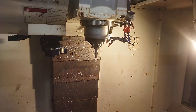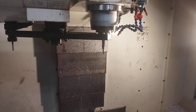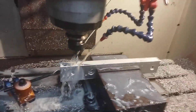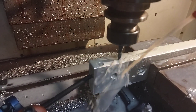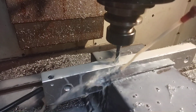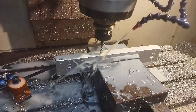So anyway, back to this machine. We're changing to a tap now — it's an M8 tap with a pitch of 1.25. Getting a close-up in case I snap it. Don't you love rigid tapping? And that's cycle done.